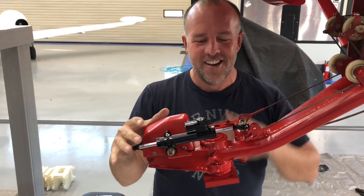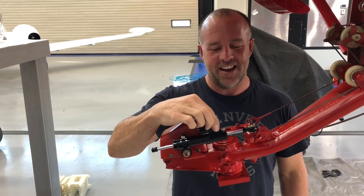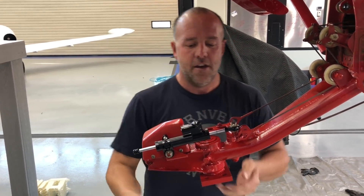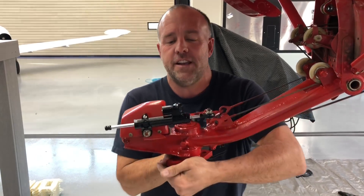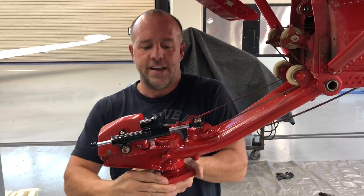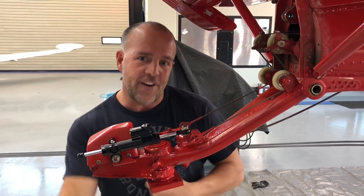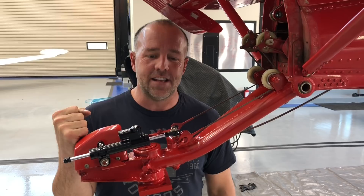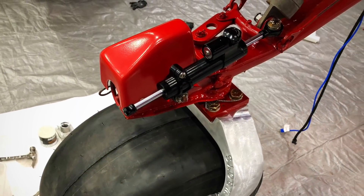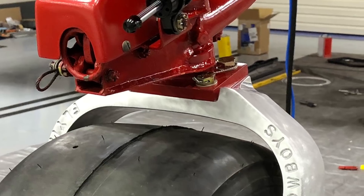Getting this to work - it looks simple now but it kind of sucked. Now that it's done it's awesome: I can change the tension of the dampener, I can still go 360 degrees, I still have full steering on my tail wheel. What's nice is I can turn it easily but I can't move it fast. Now to assemble the rear tire with the new fork, spacers, and bearing sets I made, and we'll put the back end together.